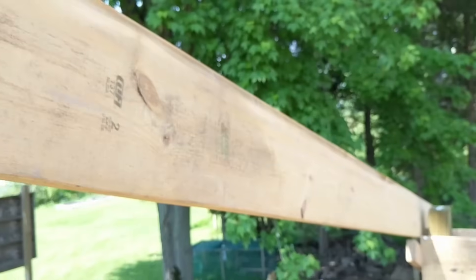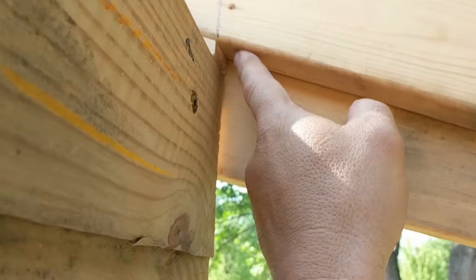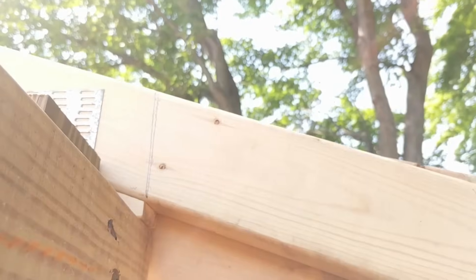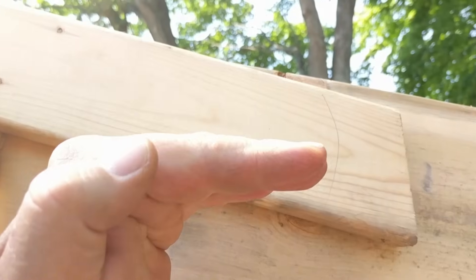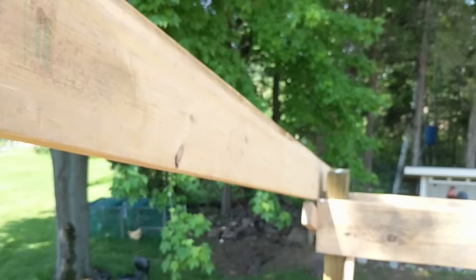Here's my rafter. You can see that's where I'm going to cut my truss tail off, and the rafter is actually going to sit in the same plane as the rest of the truss. So the truss will just continue, it'll hit the rafter, the slope will come up a little bit and finish off the rest of the way down.